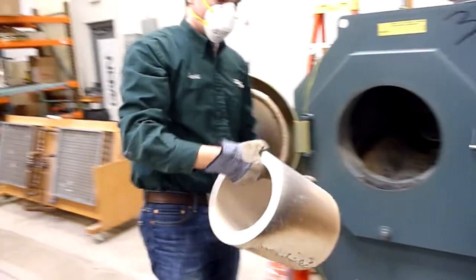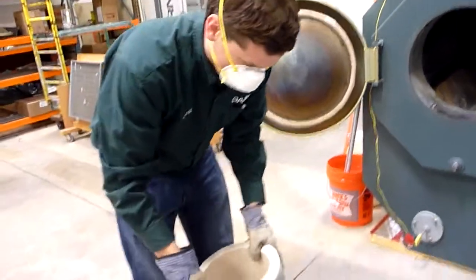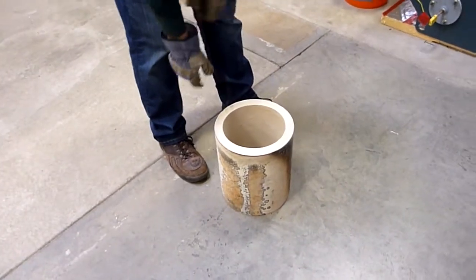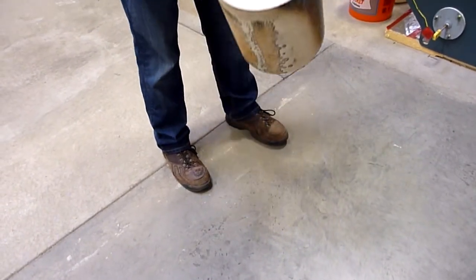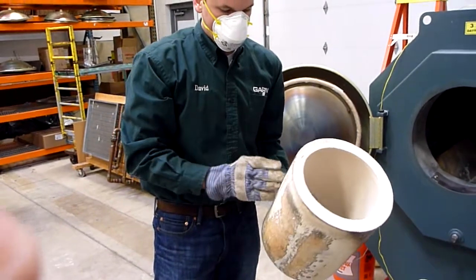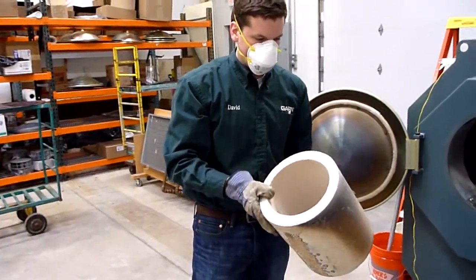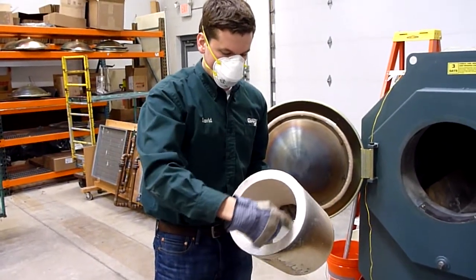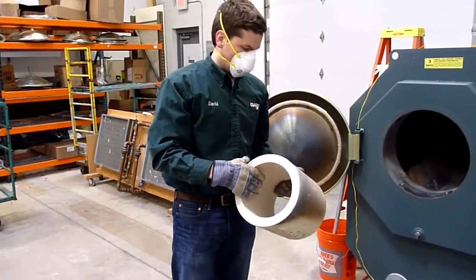You can reach in and just take a look at it. This one doesn't have any damage — it's only been burned a few times. But the first section of the reaction chamber is what takes the brunt of the abuse. What you're looking for is if there's any major cracks, damage, or major erosion. Usually this inside lip is what gets eroded over time because the air is passing through.